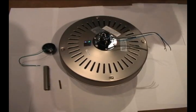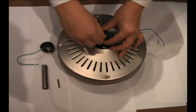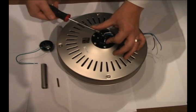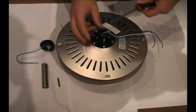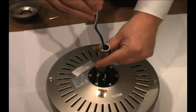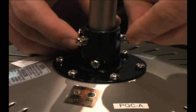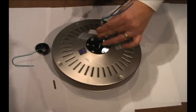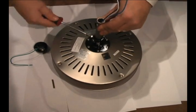The next process after doing your blade irons and blades is putting the down rod onto the fan. The fan comes with many safety features. One is the safety pin — it has to be removed from the fan first before putting the down rod in. You also have to back out the safety screws, which helps keep the fan balanced and the down rod firmly in place. Once you have backed those out, put your down rod in and run your wires through the pipe. Line up your holes, push the pin through, and put the safety clip back in. Tighten up your screws to keep your down rod from moving — this is very important in keeping the fan balanced.